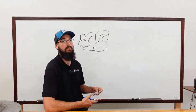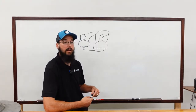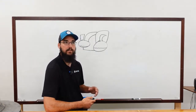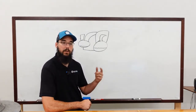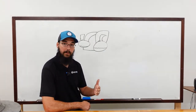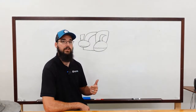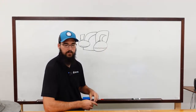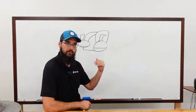And that's another thing you have to be careful with too: when a machine sits idle for a long period of time, the seals can sometimes get displaced, is how I'll say it. And that can allow some leakage. That's why it's always really good to make sure you're cycling and routinely swapping your machines on a lead-lag basis, once a week or however you decide to do it. That also helps those seals in the system stay fresher because of vibration and use, and ultimately it's going to help prevent leaks that may not have formed.